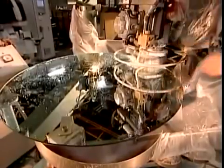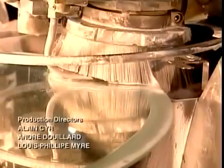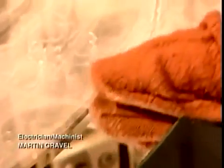To make beveled mirrors, they use what's called the shape bevel machine. First, it carves out the edge, then polishes it to a shine using concentrated cerium oxide — a stronger version of what they used earlier to clean the glass surface before plating it with metals.